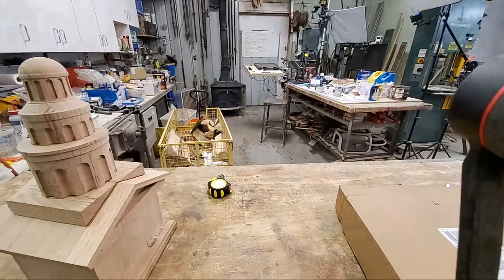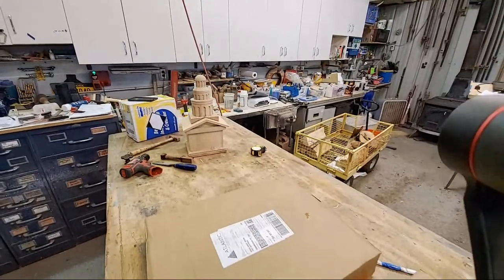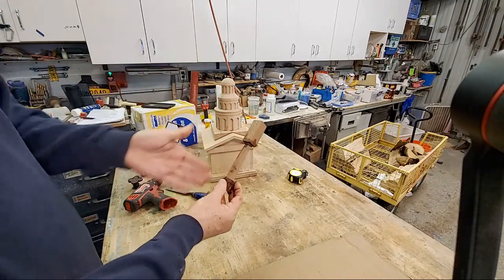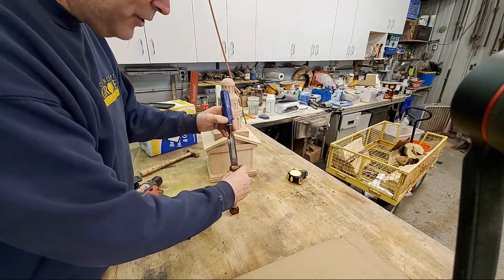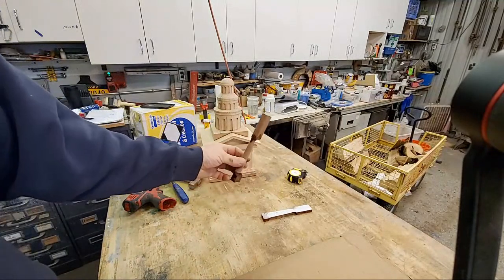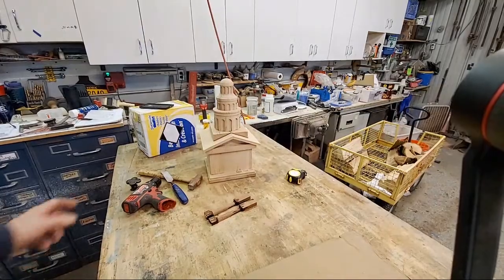So this is sort of a gift to the University of Rochester — a birdhouse I've been working on forever. It's a fun little project. I had to make a fluting jig for my lathe and I use a duplicator to duplicate these columns, which will go on. I'm doing a half or a colonnade. I glue my two pieces together with a piece of paper — that's a great trick. Put a piece of paper in there, turn the piece, it's strong enough to hold while turning but weak enough to pull apart in half. I'll cut those down and mount these colonnades around the piece.